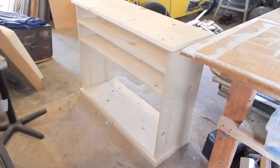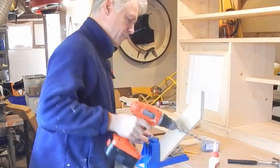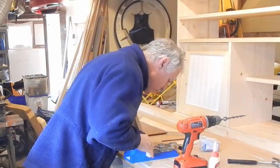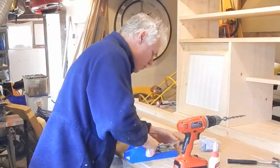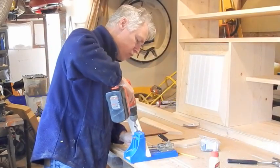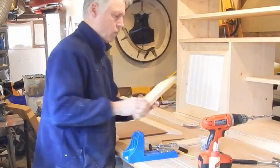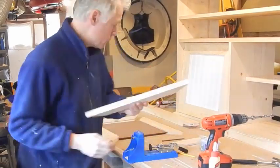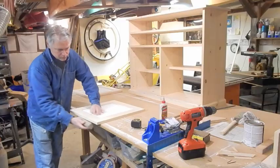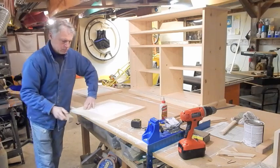Well, just nailed the top down. Here I'm making the doors, but before I cut them up on the chop saw I ran the inside edge down on the table saw twice — just wide enough to where the panel could fit in a little groove, kind of sandwiched in between the frame. Pretty slick. And here I'm giving it a cursory sanding, basically smoothing off all the sharp edges on the boards.